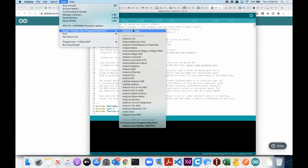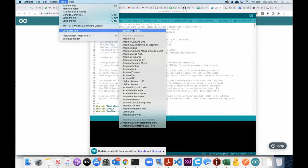If anyone is following along and wants me to slow down, please let me know and I will. I think you mentioned earlier that you should not have Makerverse open at the same time. Should I close both programs and reopen the Arduino? You can close Makerverse if you like. If you're on a Mac, make sure you do an actual quit and not just close the visual window, because the connection services will stay running in the background if you don't quit the application.